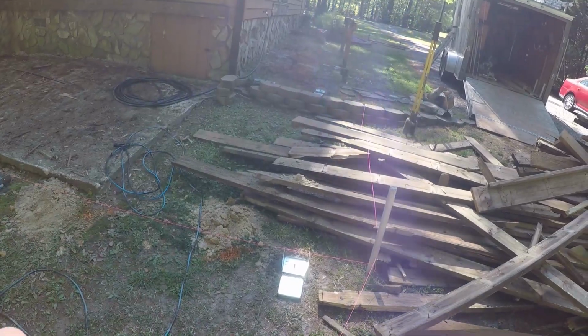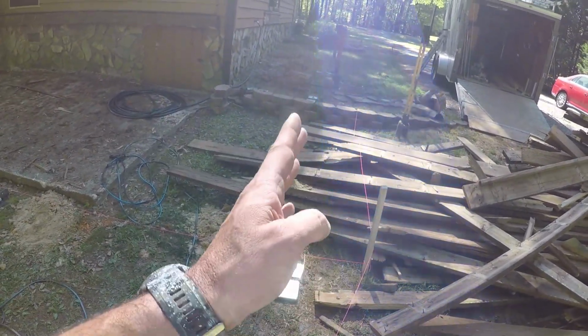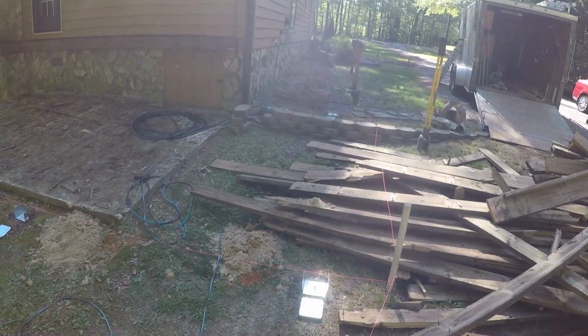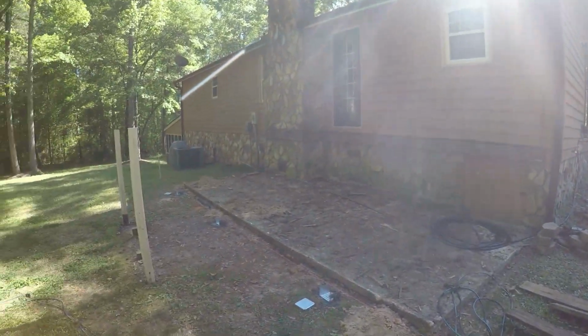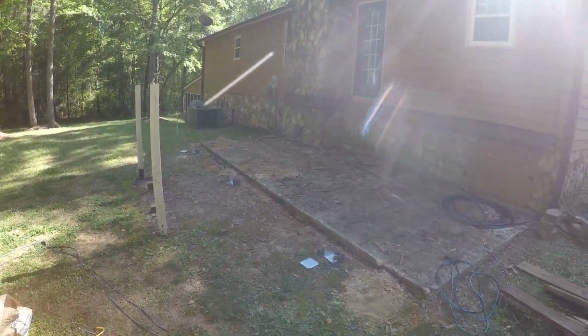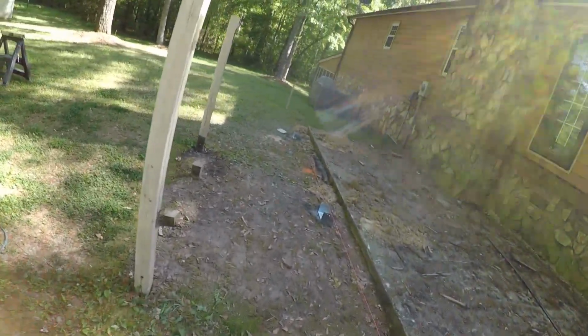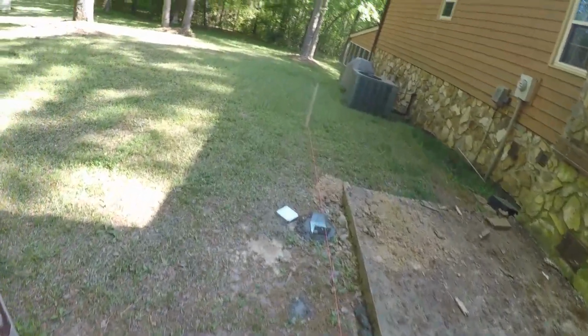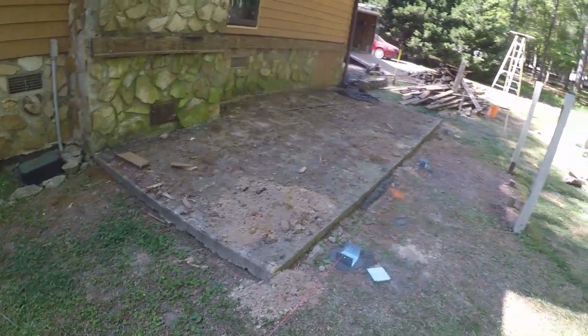The joist will come this way and the beam will run past this post, and then I can set my joist on here and square this deck up with the joist, and then just cut my beams, cut the length off of them when I get done. I really like doing that because it looks better. I like my post and the beams to kind of set in so it doesn't draw attention to your eye.